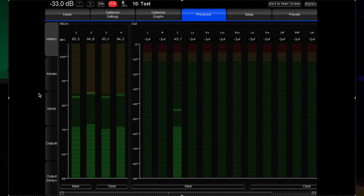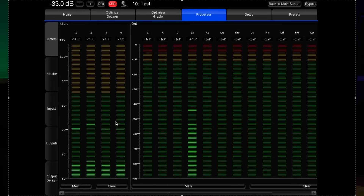When you get to the sides, the volume drops down to about 70 dB — so we're looking at about a 12 to 15 dB difference between the LCRs and the wides. When we ran this calibration initially with Chuck, he noticed that and said that's a wide disparity. So what we need to do is decrease the dB level on the LCRs and then bump up the overall volume so that we can get those two volumes a little closer together.